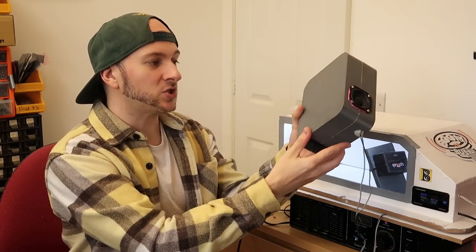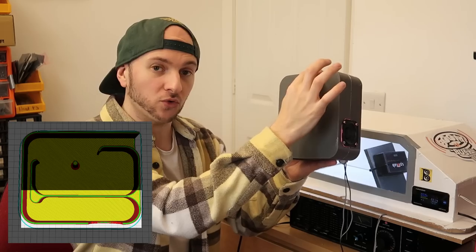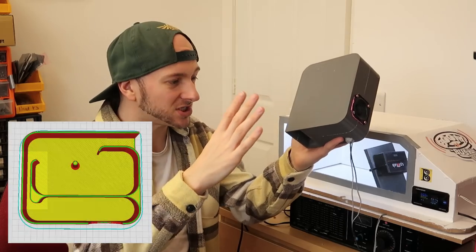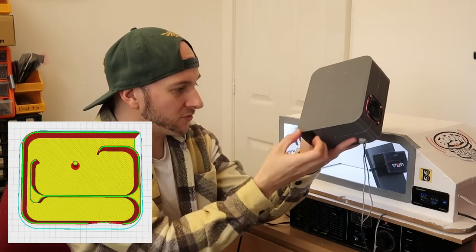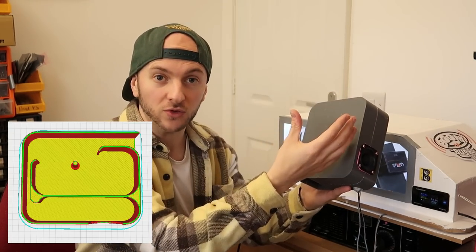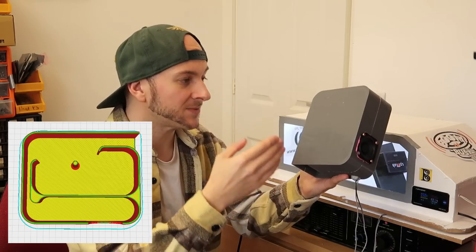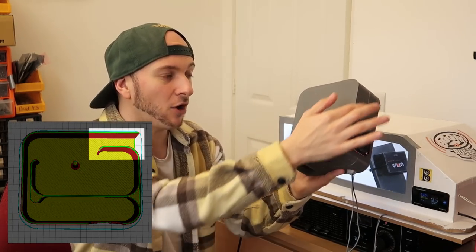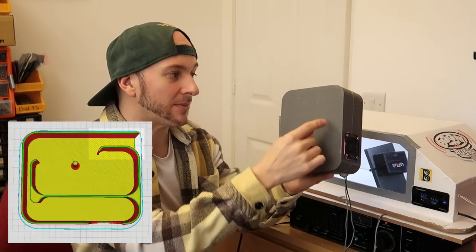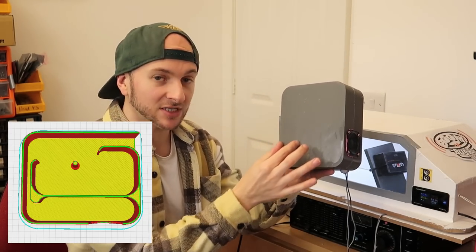Anyway, the way that this enclosure is supposed to work is at higher frequencies, the driver sees just this first chamber, and this port loads at higher frequencies. And the output from this port is channeled past this second chamber, which is not supposed to really change the sound at all. It just kind of routes its way out of here at higher frequencies. But then at the lower frequencies, this port unloads, therefore just giving a clear pathway for the enclosure to see the rest of the box, whereby this second port loads at a lower frequency, because now we've got this whole box that the driver is seeing, the whole volume, rather than just this first chamber, because that port is now unloaded.